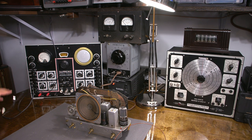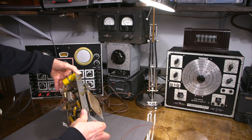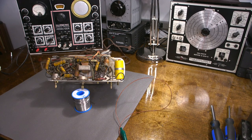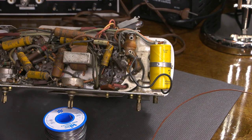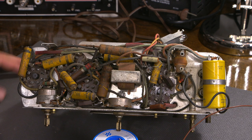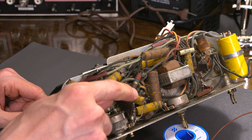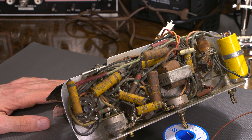The next thing to do is get on the bottom side here and start checking some of these components. I bet a lot of these components are very, very bad, but this thing is still working. Look at this - this one here has even squirted some wax out of the end of the capacitor. This has been so hot that it actually squirted wax out of the end. You can definitely tell this thing has just been baking. What I'll do is remove some components and we'll test some components together and see how incredibly bad these things are.